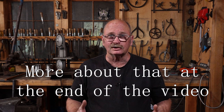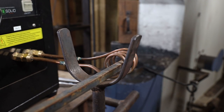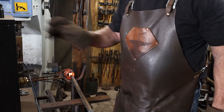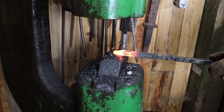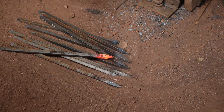When I first started doing these, I was doing it all by hand at the anvil. It was time consuming, tedious, you wore yourself out, and the hourly rate was really terrible. It was one of those things I regretted taking on — this was going to be a long-term job for as many as a thousand in a single setting. I was younger and more naive back then, and I took the job way too cheap. As we did more of these, we added the little giant power hammer and the fly press. With the little giant, we'd sit on a stool with about a dozen in the gas forge, pull one out, forge the point, put one in to replace it. The only downside was if you screwed up and had to go to the anvil to fix a problem — they'd start to get too hot to hold. The induction forge doesn't do that, so I'm glad to have it for this batch.